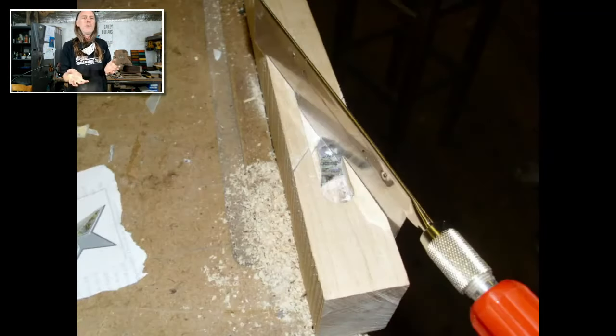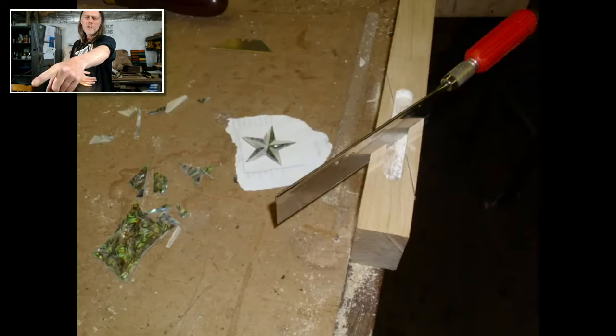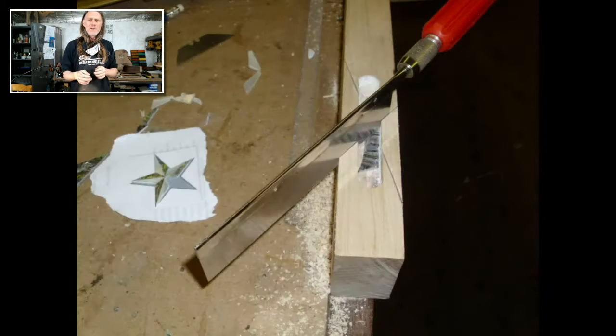I was actually looking for that jig earlier. I was hoping that I could have it here to show you, but it's really simple. Just a slot with two cuts, and we do two cuts. You're left with a triangle piece. You can just see the star form in there on the edge of the screen. There's the star, fully formed, with mother of pearl, abalone, mother of pearl, abalone. So you can use the two different colours to make a three-dimensional effect.